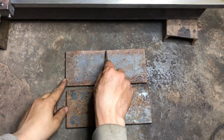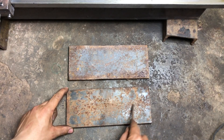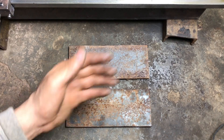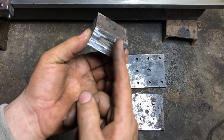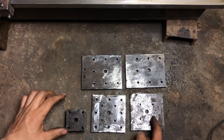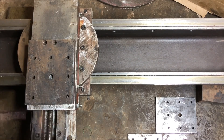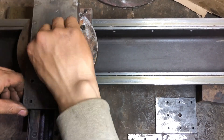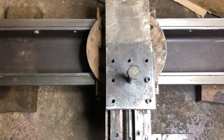Now we are going to make the tool post. I used 10 millimeters thick steel plate. The tool post will be 10 centimeters by 10 centimeters. Because I don't have any thicker materials, I will make a stronger one in the future. Everything is cut and this piece is made of three parts — one is 5 by 5 centimeters and the other pieces are 10 centimeters by 10 centimeters. This piece will bolt onto the cross slide, and in the middle it has a threaded M12 hole and is bolted on with seven M6 bolts.